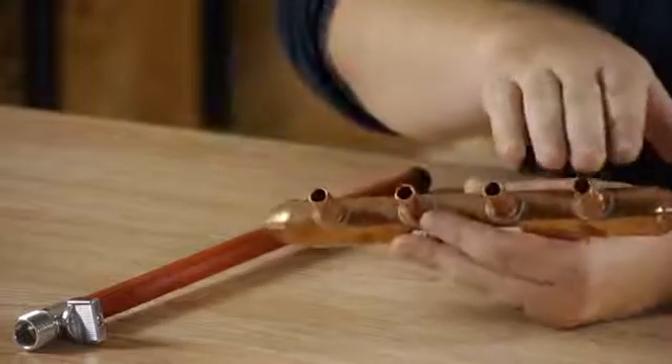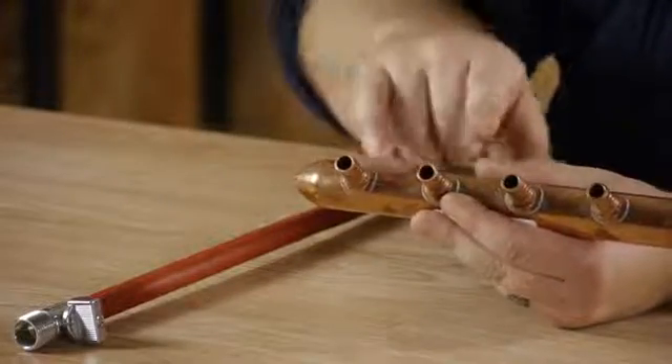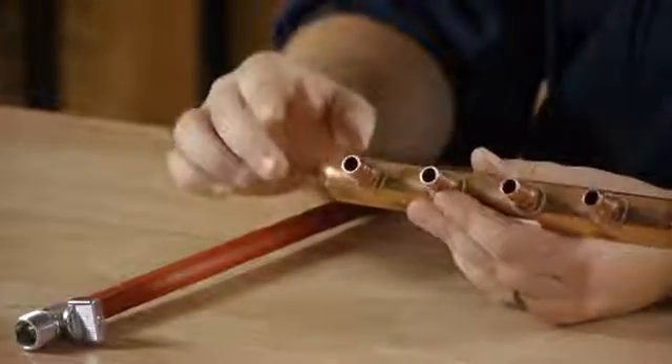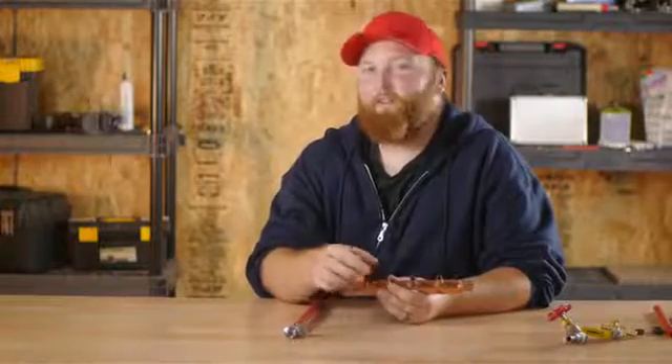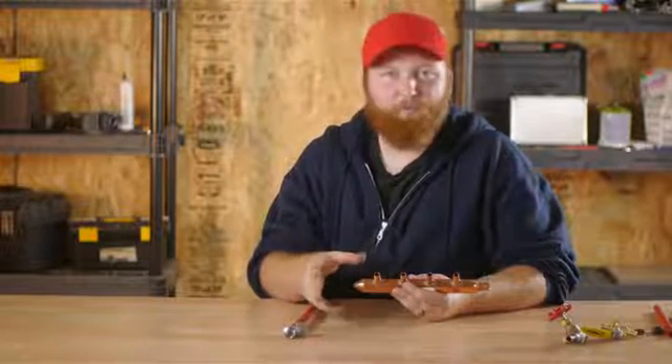Out of the manifold, you have half-inch PEX coming out. You'll run each one of these to each individual faucet — so you have one line for the toilet, one for the sink, one for the shower. All those are designed to be run in a half-inch PEX. You don't want to go bigger than that because that allows too much water pressure to flow through there.